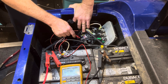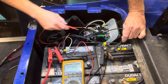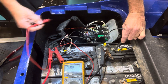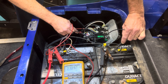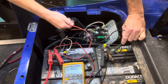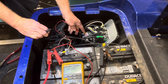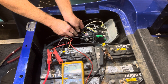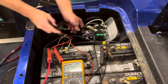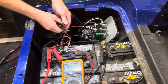Now, a lot of people ask me about the solenoid. On the small posts, you've got a blue wire and a yellow wire. In forward with the key on, you're going to show positive voltage on both small posts on the solenoid. The blue wire is your ground — it changes voltage from hot to ground and engages the solenoid. If you put the red lead on the yellow wire and the black lead on the blue wire, when you hit the gas you'll have battery voltage. But this one clicks in and clicks out so fast — you see it try to change but it won't, which means you're getting battery voltage.